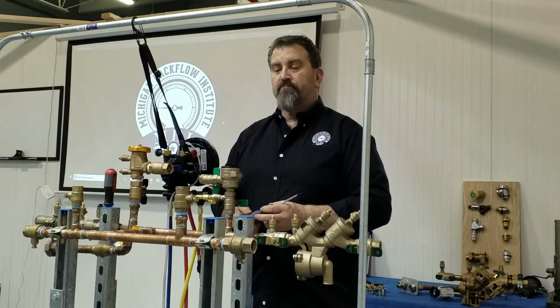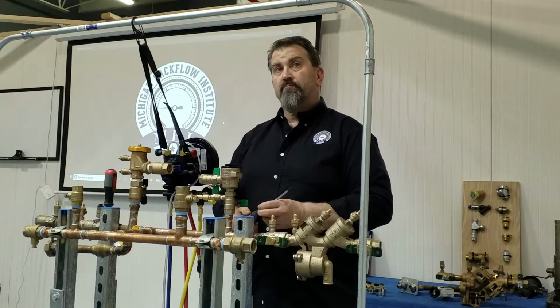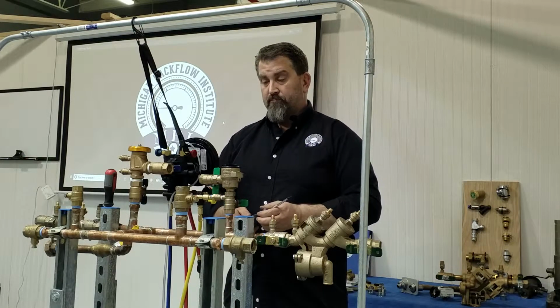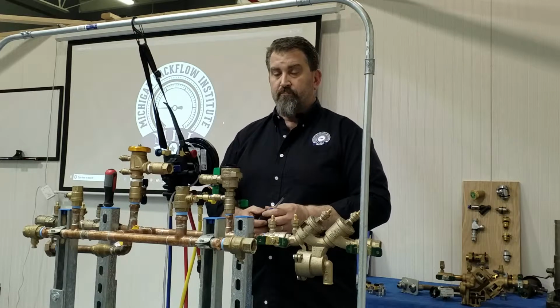If the air inlet is visually open when the differential gauge reading is 1 psid or greater, record the valve as passed. Lastly, restore the system.